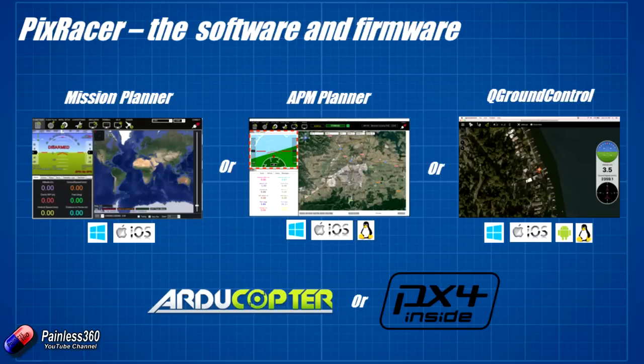The other option is PX4 firmware. PX4 is only there to support the Pixhawk platforms, so it doesn't have to worry about running on multiple boards or all the regression testing that Arducopter does. It's a slightly different implementation and does things slightly differently. We've never used PX4 on a Pixhawk on the channel, so that's the one we're going to use. Now we know we're going to use QGroundControl and PX4, let's plug this board into a laptop, make sure it's all working, and then talk about how we'll connect it all up ready for the next video.